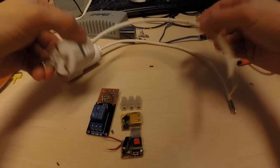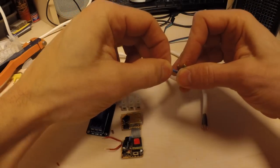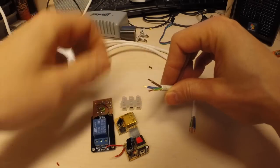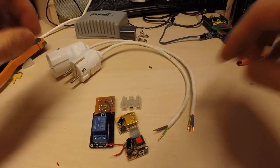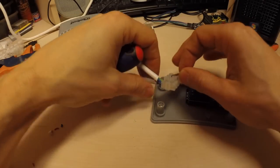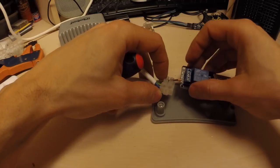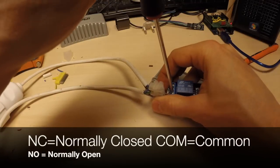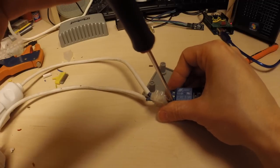I have prepared two cables here — power in and power out from the relay. Once again I'm using grounded cable for extra safety, and that is really good to have. I really suggest that anyone doing a project who has the ability to use ground inside should use it. We're going to connect this now — almost put that one wrong because that one is outgoing, so that should be in the normally closed terminal.